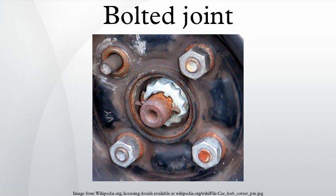In reality, the fastener carries a small fraction of the external load even if that external load does not exceed the clamp load. When the fastened parts are less stiff than the fastener, this model breaks down and the fastener is subjected to a tension load that is the sum of the tension preload and the external tension load. In some applications, joints are designed so that the fastener eventually fails before more expensive components. In this case, replacing an existing fastener with a higher strength fastener can result in equipment damage. Thus, it is generally good practice to replace old fasteners with new fasteners of the same grade.